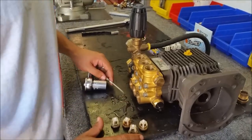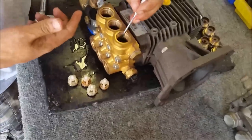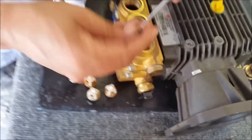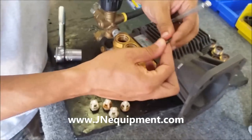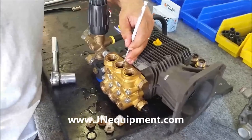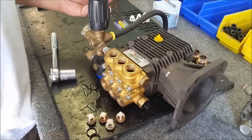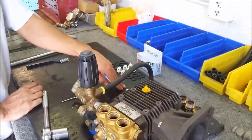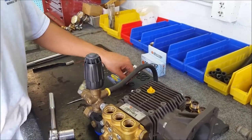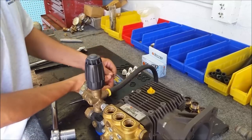The next step once you've got all the valves out: there's one more O-ring down in here and I'm just using my dental pick to go ahead and pick it out. You would also want to check this for any kind of damage. That is essentially the entire repair for the valves. Now I can come over to my new valve kit and match up the O-ring I took from the bottom — it matches with the smaller O-ring.